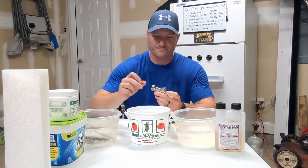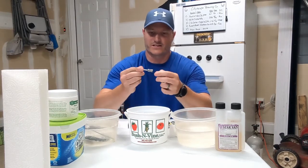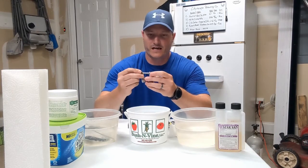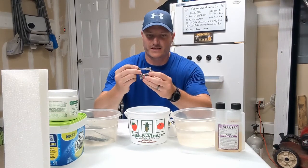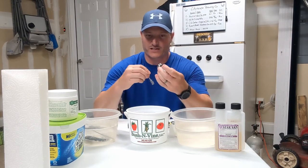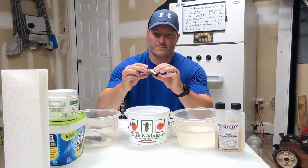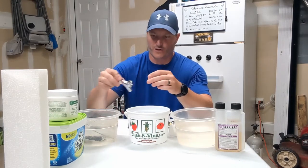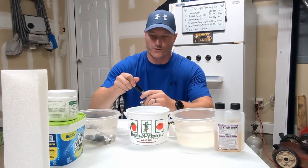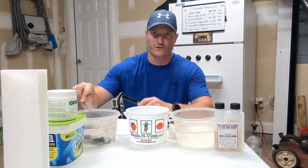The next piece you want to push from the front and take out — this is the shaft that's inside. This is actually what's stopping your beer from coming in and out. As you pull the handle back, this will pull back and allow beer to flow around the gasket and out the faucet the other side. And then this is the actual faucet body itself — I'm just gonna throw that right in the cleaner. We'll do that for the next three and then go through and use this brush to clean a few of them up.